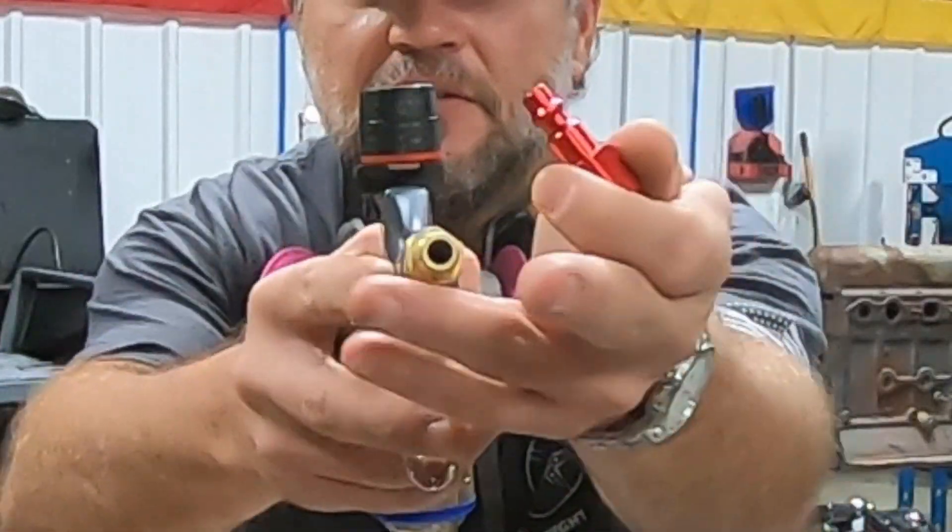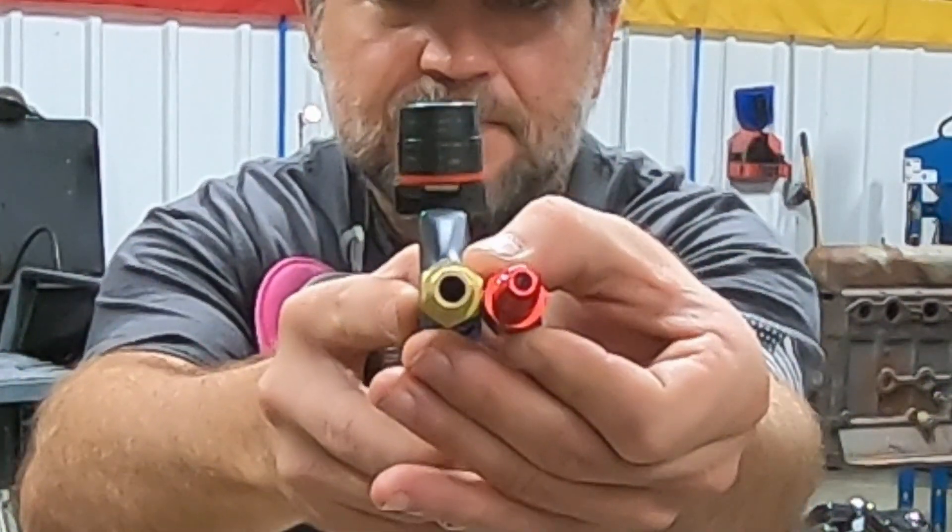One thing to address for new painters is your airline fittings. Here's a cheap one from an auto parts store — compare its size to this one, quite a bit different. The fitting I use throughout my entire shop is the Milton V-style from their Pro Flow series. I've used it for over a decade on every piece of air equipment I own and found that everything runs a lot more efficiently with this type of fitting.